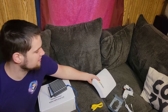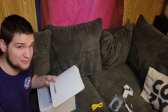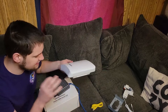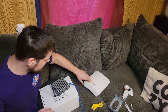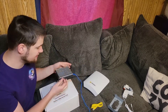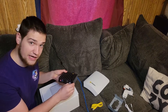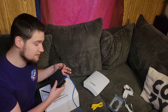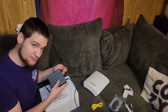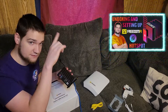To set up the indoor cell unit it's actually pretty easy. In fact, on the website it says basically plug and play — you don't really need a manual. I'm gonna show you how to do it today because it is a little confusing if you've never done it before. Basically, what you're gonna do is have your FreedomFi already set up. Remember you need to screw in a LoRaWAN antenna first into the FreedomFi, then the ethernet, then plug it in, and then it'll make that beep and the red light will come on.